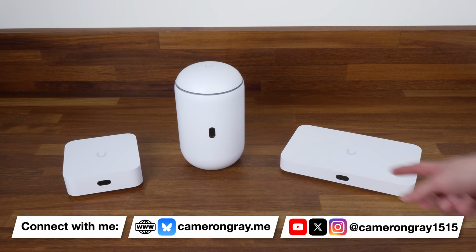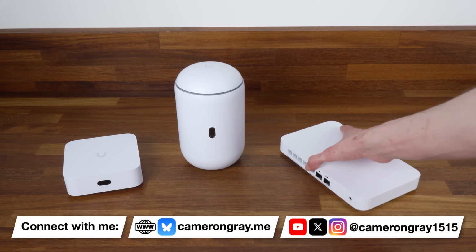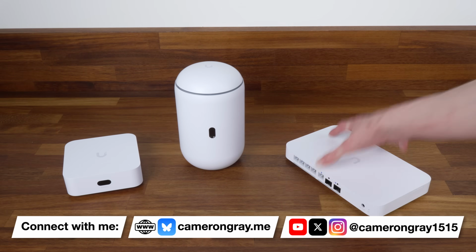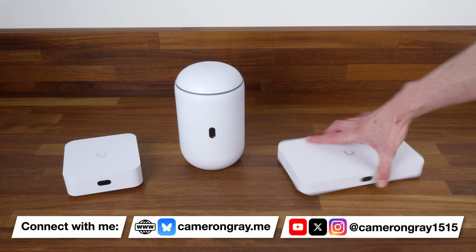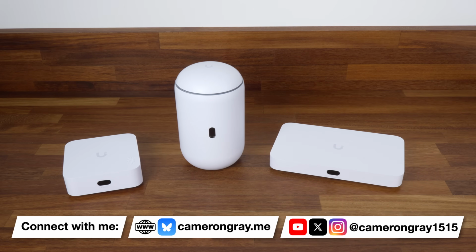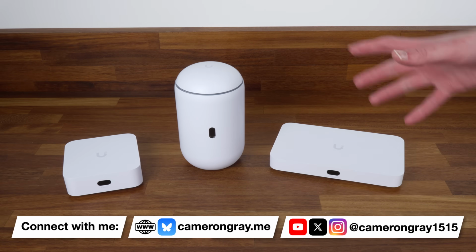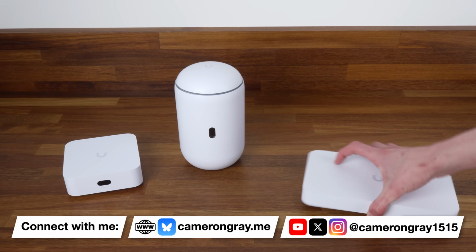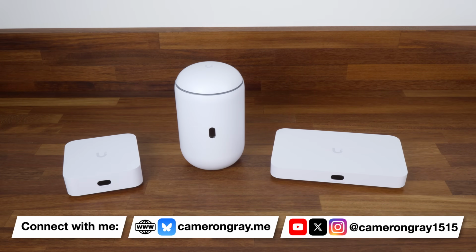And then finally, you've got the Cloud Gateway Fiber, which is quite a bit different to the other two, given it's not got built-in Wi-Fi and it's got multiple 10 gig ports, and it's generally designed for a higher end environment. But I could see this being really useful in small offices, little branch office type things, places where maybe you've not got a full-on wired infrastructure, you've not got a comms rack, you've maybe just got laptops and stuff around a room, maybe some basic cabling going to a small patch panel or a few wall ports. Something like this where you've maybe not got a comms rack, but you can have one of these, maybe a separate switch just sitting on a table or a shelf, all working together.